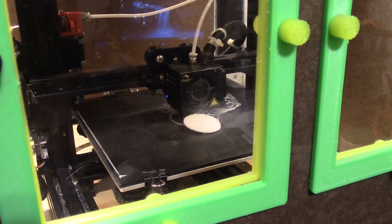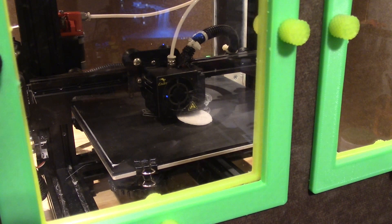Well, apparently roughing it up didn't make it any better — it made it worse. Let's stop it. Okay, I flipped it over to the shiny side and re-leveled it and cleaned it with alcohol. One of the problems seems to be that it doesn't seem to be an extremely uniform thickness, and I'm not sure what I can really do about that, but I think I got it set pretty well for the center. Let's try it one more time. That's not working — I can already see it lifting, so I'm going to stop it here and try going back to the other surface and scuffing it up with some really rough sandpaper.